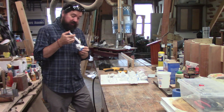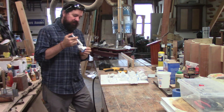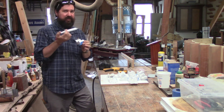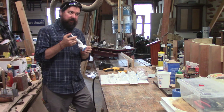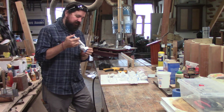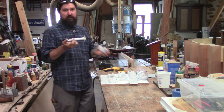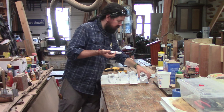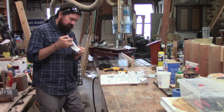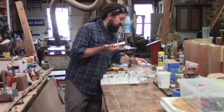This is just straight epoxy, not filled. I tried using a minor filled epoxy with just a little bit of filler in the syringe, but even cutting the tip all the way off, it's just not viscous enough — or rather too viscous. To combat the viscosity, you'd have to have a syringe that could achieve a higher pressure. And if you had a lot of filler, it wouldn't soak in at all — that's my experience with epoxy. That's why I'm using it straight.